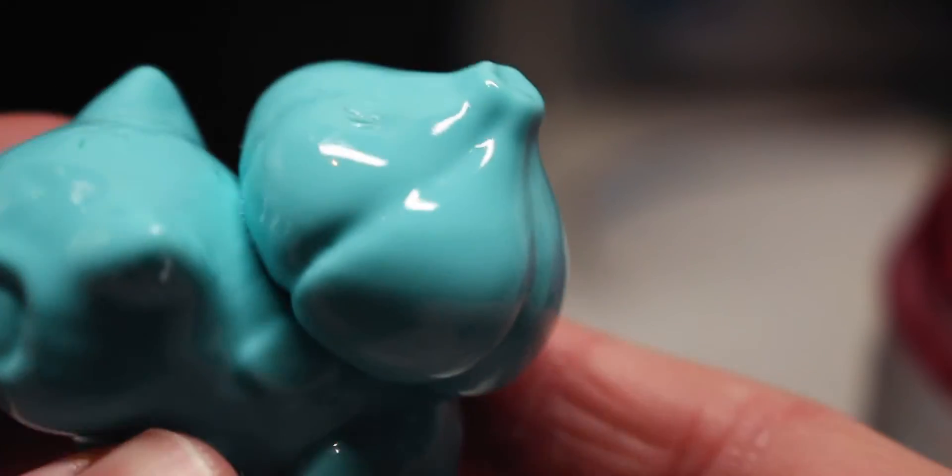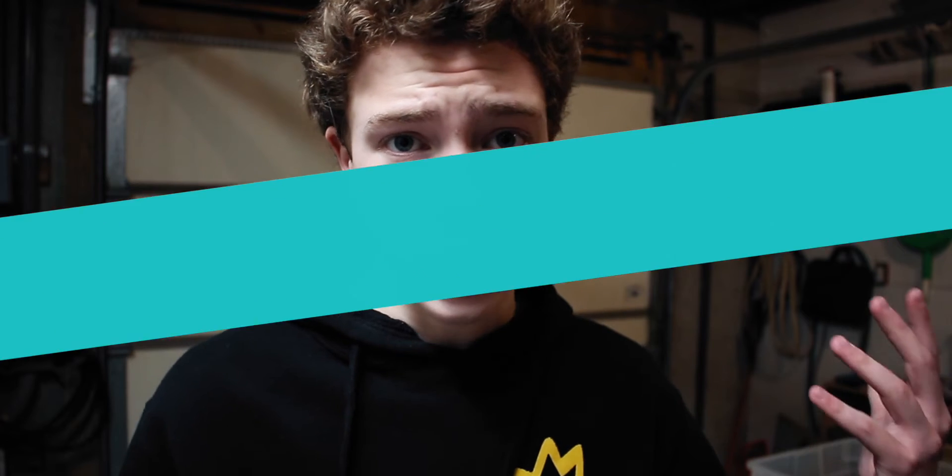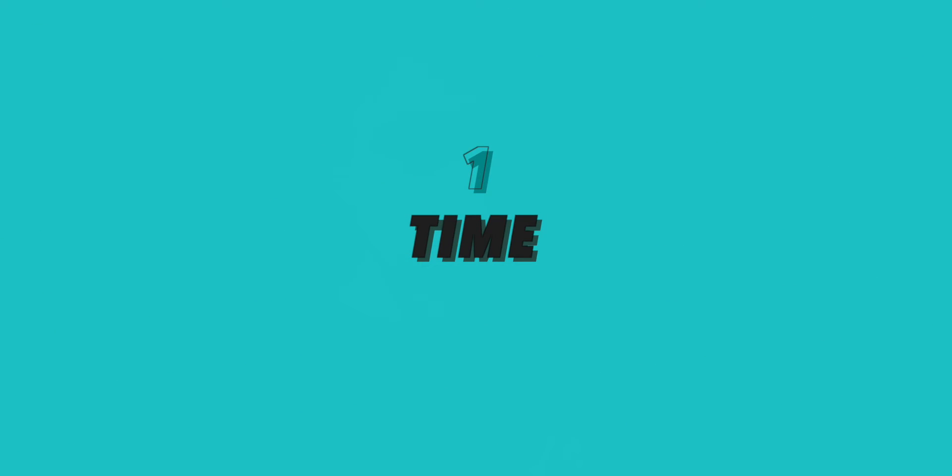Overall I think it's quite a good process, but there are definitely some downsides. The first is that it takes much longer than acetone smoothing with ABS plastic — I had to leave this in for about 12 hours to get this finish, and even 6 hours wasn't nearly as smooth as I wanted. So I think this is more of an all-night or all-day process, whereas with ABS you could get this level of smoothing in just about 2 hours. That said, this will vary depending on your setup, but it will definitely be longer than whatever you're currently doing with ABS and acetone. You definitely do need to use 91% isopropyl alcohol — that was much, much better than the 50% I was using. So make sure you get the highest percentage you can.